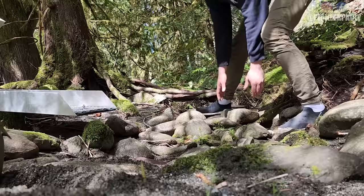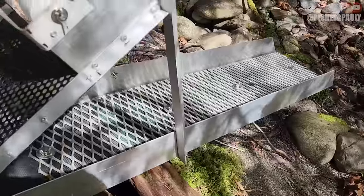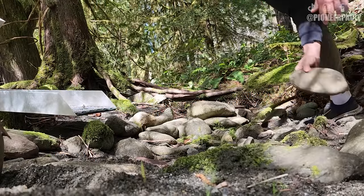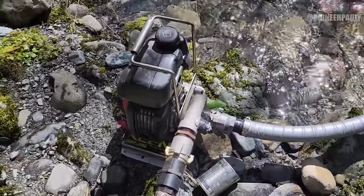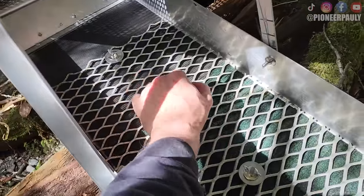Let's get the high banker set up and begin. Before I could set up the high banker I had to make a secure settling pond so that the muddy water could be absorbed back into the ground before making its way back into the river — a big rule in BC. For those who don't know how a high banker works: water gets sucked into the hose, goes through the pump, and the pump pushes the water up to the sluice box where you shovel dirt in, the gold and dirt get separated, and at the very end of the day you pan it out.